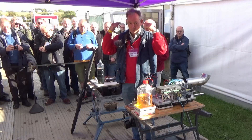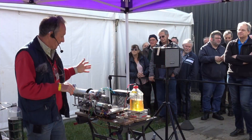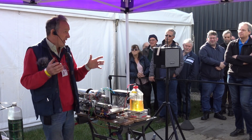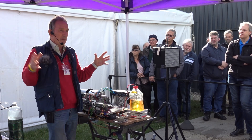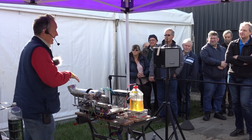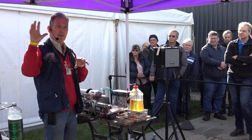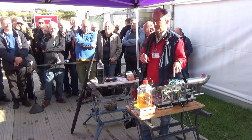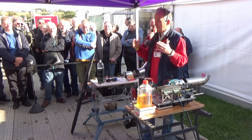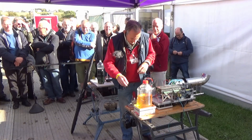It's worthwhile saving what little hearing we have. I'm going to take it up to about 110,000 RPM — that extra 10,000 up to 120,000 in this environment is not going to make any difference. What we have here is a perfect acoustic environment whereby the hard floor and the tent cause noise to bounce around everywhere, so it's a lot noisier in here than if it was on a model airplane flying around. If you have this on a model airplane alongside another model airplane with an IC engine, you can't hear this one at all. You can only fly jets together — not a piston and a jet together. I know you won't believe me because you'll hear the noise, but trust me.